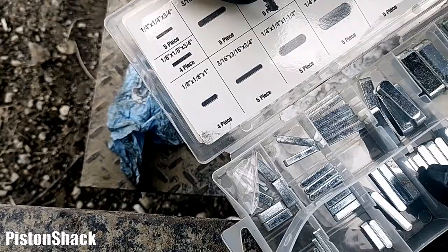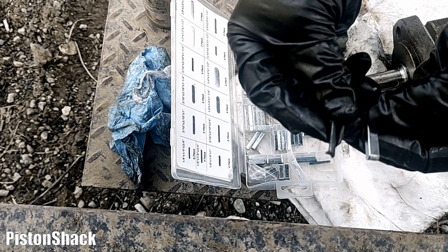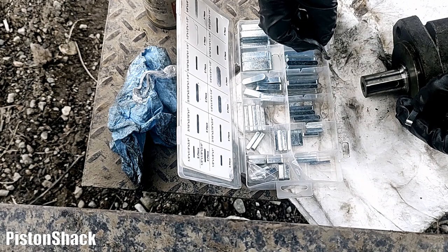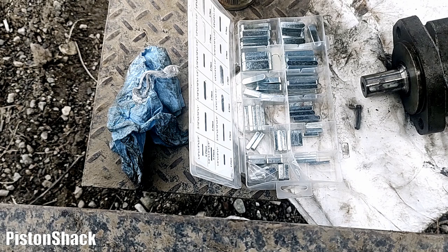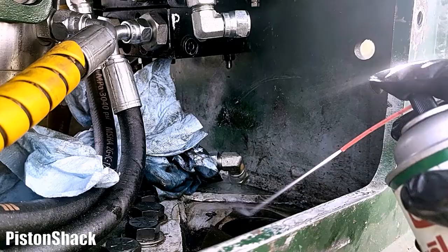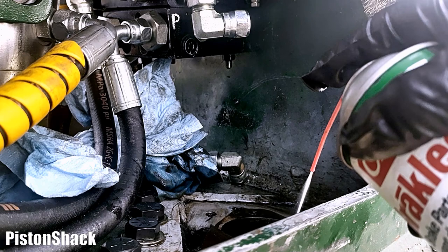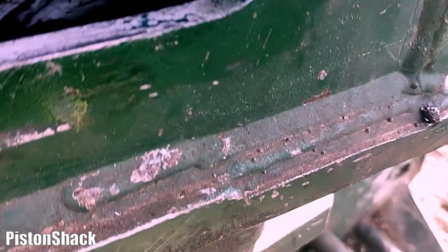If you have any questions, comments, criticisms, or suggestions, put them down in the comment section below. We have a key — same size, same key, just a new one. I'm putting a little bit of anti-seize compound to keep the key in the slot when we'll be installing the hydraulic motor, to make sure the key won't fall out. As you can see, the key is staying in place. Let's do a little cleanup with brake cleaner before we start putting the motor back — just clean all that grease and hydraulic oil.